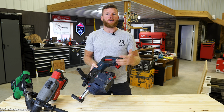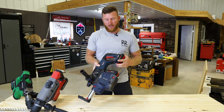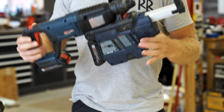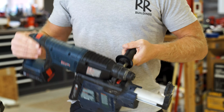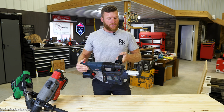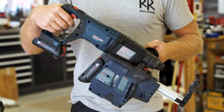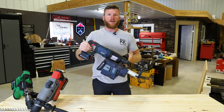And like I said, I was able to drill, I think, don't quote me on this, I think I actually quoted it in the video in the building series, but I was able to drill and vacuum out, I think it was like 80 holes, so it's pretty impressive technology. Even with the HEPA extractor attached to it, it doesn't make it overly bulky. It's still way less weight, way easier to manage than one of these larger SDS Max drills that I do have also. And what's nice is the D handle design that is so common with this Bulldog, it's really nice if you're working above head or on a ladder. It's just very ergonomic and comfortable.